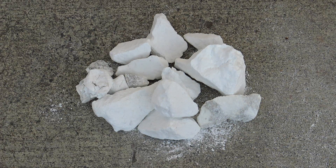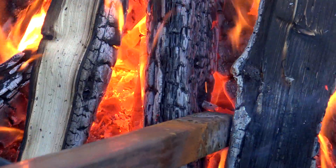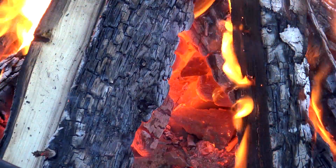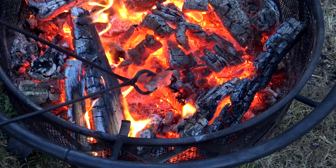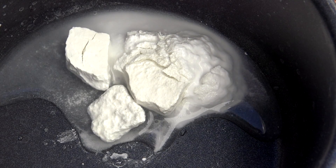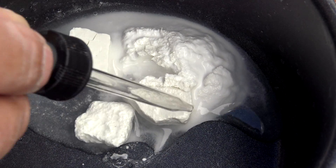Another way to produce calcium oxide and ultimately calcium hydroxide is to grab ordinary limestone rocks — the more chalky in appearance the better. Place them inside a fire pit, foundry, or forge and superheat them for three to four hours until they glow red. After superheating, remove them, let them cool down, and just like the seashells, add water. The rock actually disintegrates and turns into a paste through the same exothermic reaction, becoming calcium hydroxide — one of the building blocks for your limecrete or concrete.